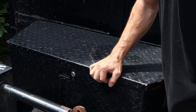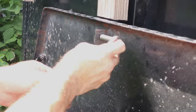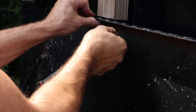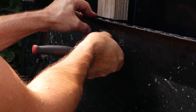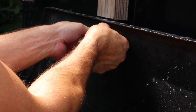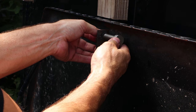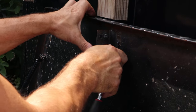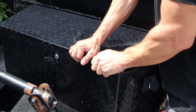The top's kind of loose — not going to hurt anything, but it really annoys me. Such a simple repair, we'll fix it. You just loosen up the striker and move it back, or up depending on how you look at it. Tighten it back up and now it fits nice and tight.